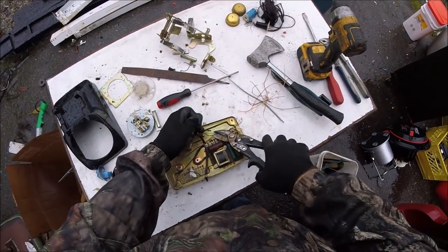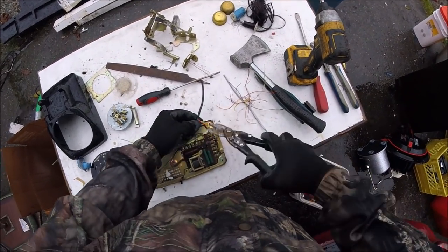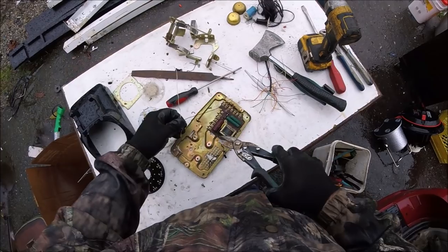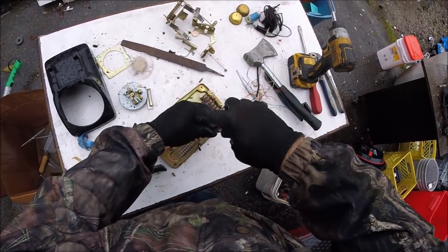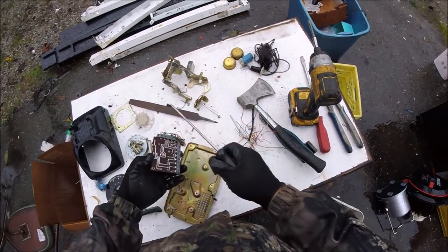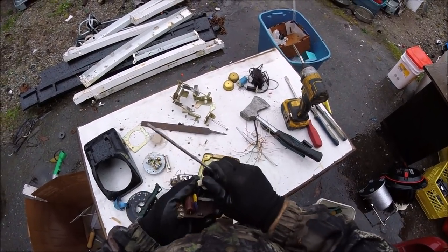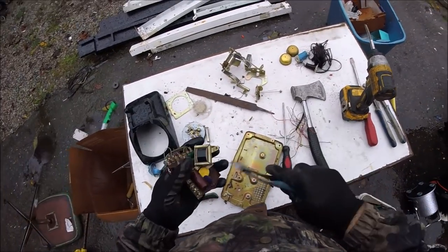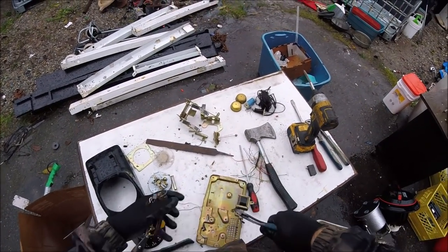A bit of low grade wire. Okay, so we got a transformer here. It's coming off next. When you do deal with transformers, guys, just be careful, especially the older ones, prior to 1970s. Because you're thinking the oil, you think it being oil, but it's not oil. Well, it's oil and paper, soaked into the paper, if you know what I mean.